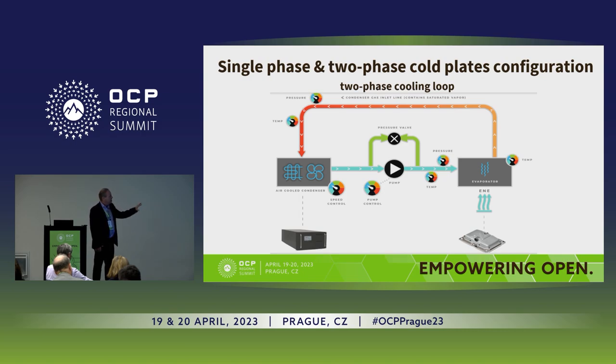The two-phase is not much different. The main difference is that the cold plate is actually an evaporator — liquid comes in, but it boils inside and comes out as vapor carrying the heat. The CDU, which used to cool hot liquid back to cold liquid, now condenses the vapor from vapor back to liquid. There's also a reservoir, a pump, and pressure control, but the loop is very similar — it's the physics around it that is different.